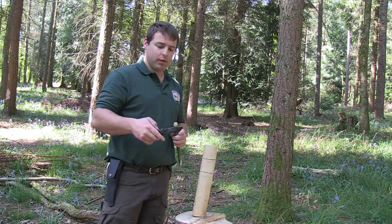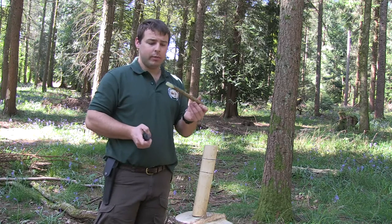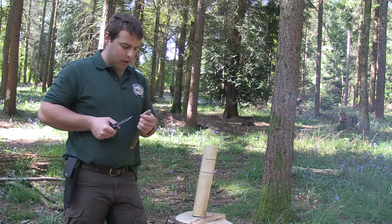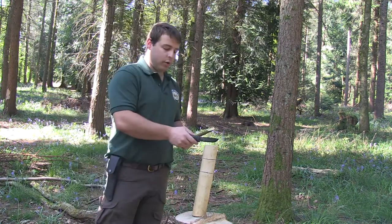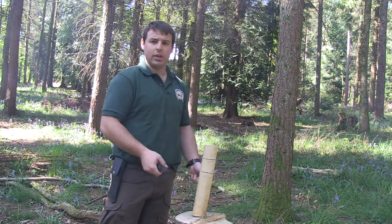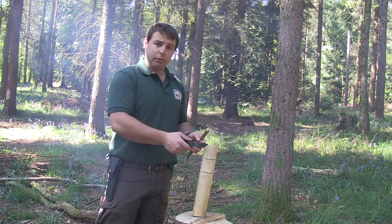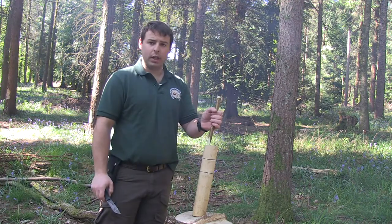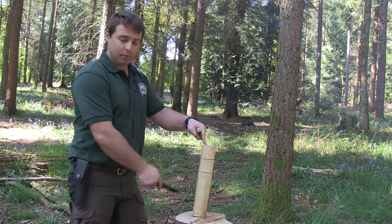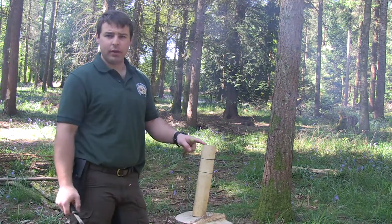When I use a belt knife, because the cutting edge is shorter, I always bring a wedge with me or make one. If your knife gets stuck in the workpiece, instead of wrestling it out and potentially cutting yourself, you leave the knife blade in there, stick the wooden wedge over your split line, and the wedge will continue splitting the wood. That allows your knife to safely fall to the floor so you can pick it up safely afterwards.